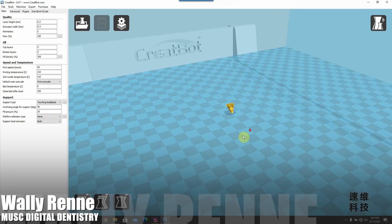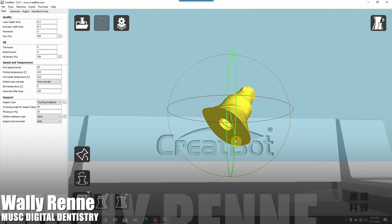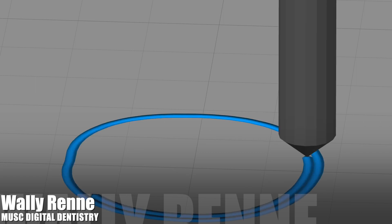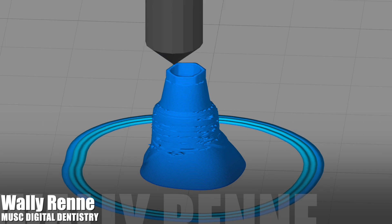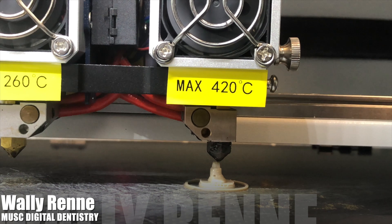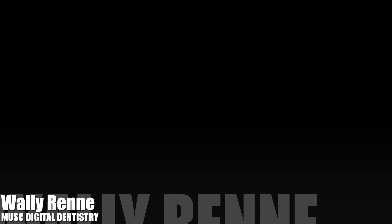With that custom healer, I'm going to FDM print it — and we're FDM printing some PEEK: polyether ether ketone. PEEK is one of the most biocompatible polymers we have and it's extremely strong. When you print PEEK you can screw it in and it doesn't break — it's extremely durable. Here it is printing on my CreatBot F430, which is a PEEK printer. This extruder goes up to 420 degrees and we have PEEK filament. PEEK filament is wicked expensive, but this part still costs me about 50 cents. That's one way how you could do this. I hope you learned something and I can't wait to see what you all do with it.